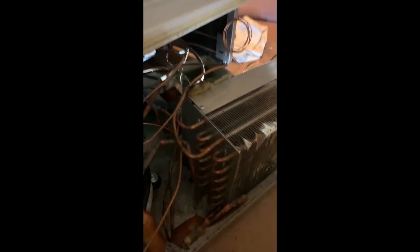Your solenoids are located screwed into the condenser right there — upper and lower. They are definitely labeled, though I think they are the same unit, so if you mix them up it's no big deal. However, you do have to know which heat exchanger capillary is for which side.